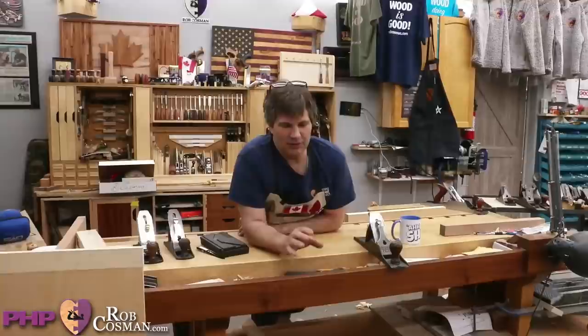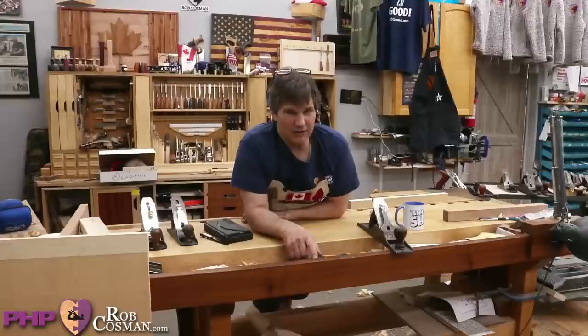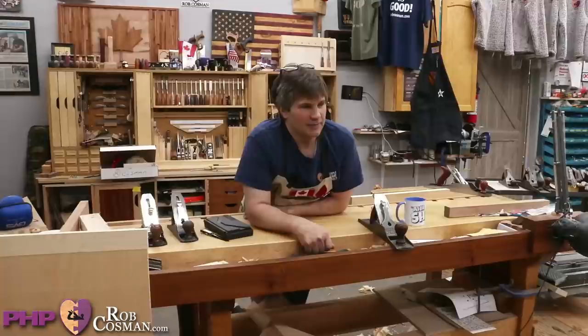Next question comes from Herbie Grief in northeast England. He says: should plane blades be heat or cold treated in any way before sharpening? No. The plane should come to you ready, with the exception of sharpening. You should not be satisfied with the level of sharpening the blade comes with — that's something you personalize. It only comes pointed; you make it sharp. If there's a problem with heat treatment, you've got a defective plane you'd return.